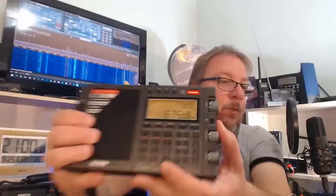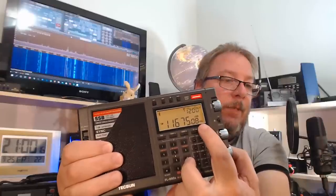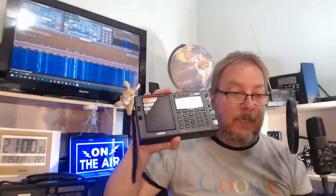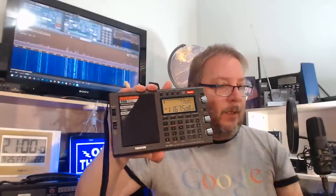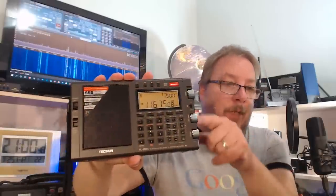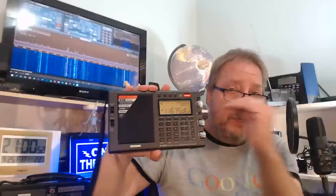Now, the good thing about this is I told you the other radios, every frequency, you have to retune the offset or the fine-tuning. Well, this one, whatever I tune to, when it's dot on frequency, it's always at 0.8 right now. So when I'm at 0.8, I'm zero beat with anything in single sideband and utility stations that is right on frequency. Makes it easier to actually tune correctly a single sideband signal because it is much more precise in its single sideband tuning. And that, once again, is a very positive option for the radio. The fact that it's off right now by about 80 hertz, like I said, is not a problem because I'll go in the menu and I will do a frequency calibration to bring it down to zero beat at 0.0. So you can actually correct that error right now.